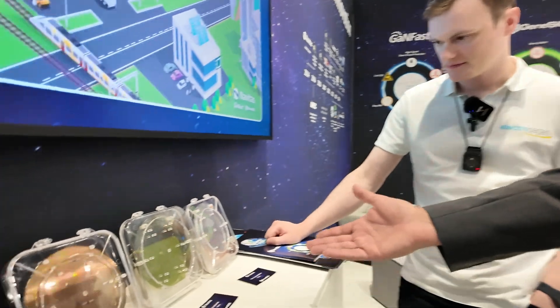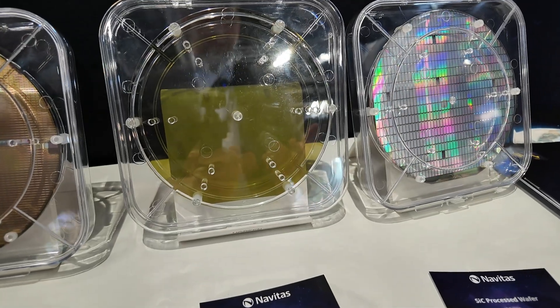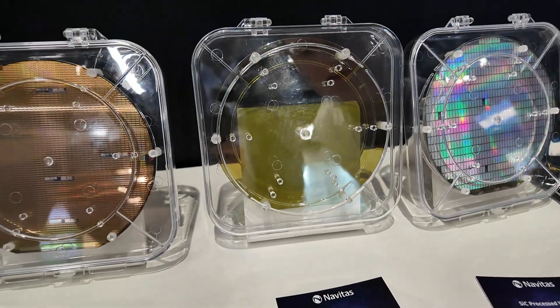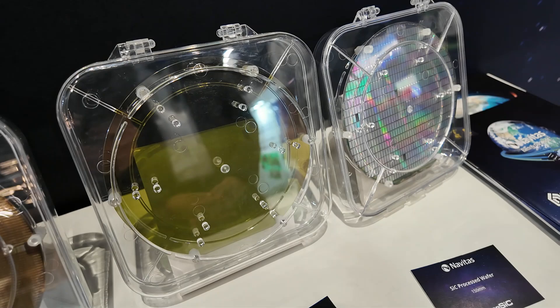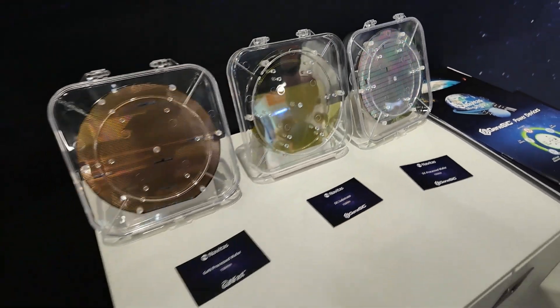So what's the second wafer? The second wafer is a silicon carbide substrate. Silicon carbide is a crystal structure, and it grows transparently — that's pure silicon carbide. It grows in a boule, then gets sliced, buffed, and CMP'd to reach this stage. The next stage is to grow an epitaxial layer, and depending on the voltage you want, you do the processing on top. The thicker the epitaxial layer, the higher voltage you can handle? Exactly — for 1200 volts you'd be maybe 10 to 12 microns thick; for 650 volts, maybe 6 microns.